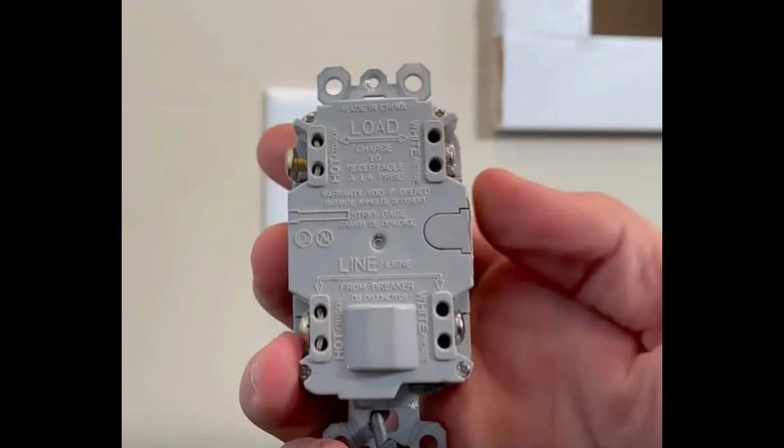There are three other wires left that are load wires carrying electricity to outlets throughout the RV, including the new one you're adding. You'll need to pigtail the wires together because there are not enough terminals for three pairs on the back of the GFCI outlet. I'll let you go out to YouTube and learn more about pigtailing — it's really easy, but it takes up more room in the junction box, which is why you probably need to get a new one. Using pigtailing, connect the load wires to the load terminal on the GFCI — again, black on brass to save your ass. Finally, pigtail the ground wires and connect that wire to the ground terminal on the outlet.